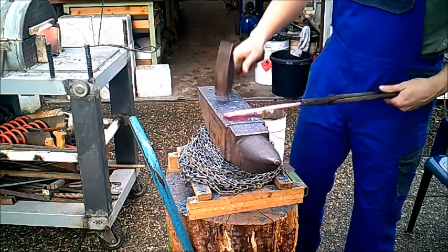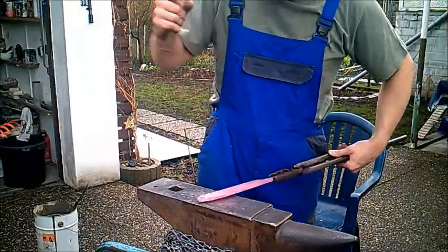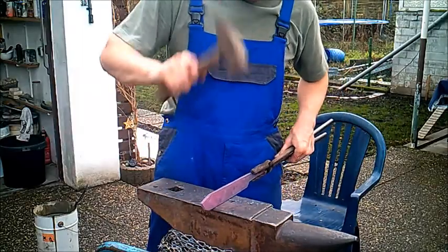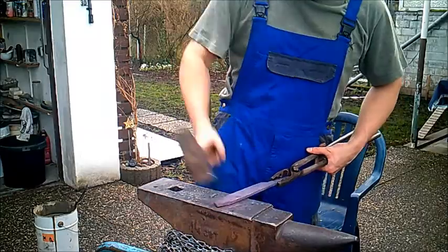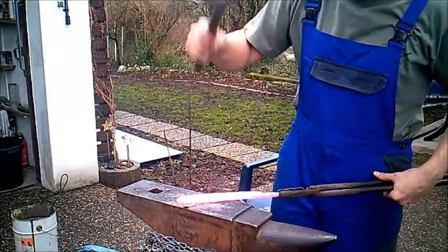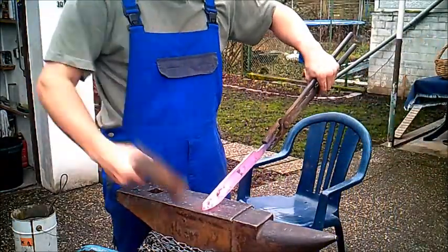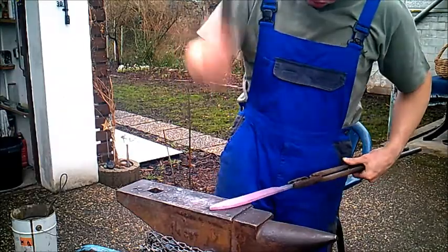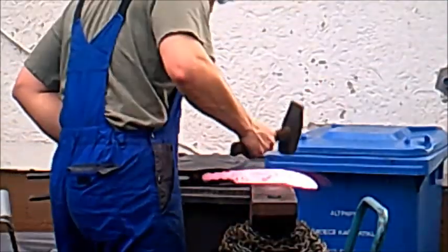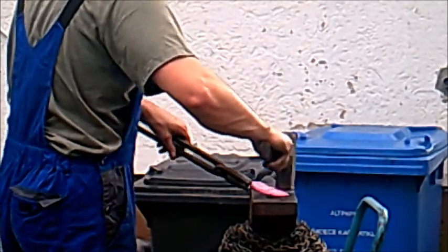I am forging out the metal. The Damascus was a little bit wide at the top, so I have to forge it out. You now see me forging the tip. You first bend the tip in the opposite direction of the tip you want at the end. That's a little bit curious, or it seems curious, but when you are forging out the blade, the whole blade will bend in the opposite direction to the back of the knife.